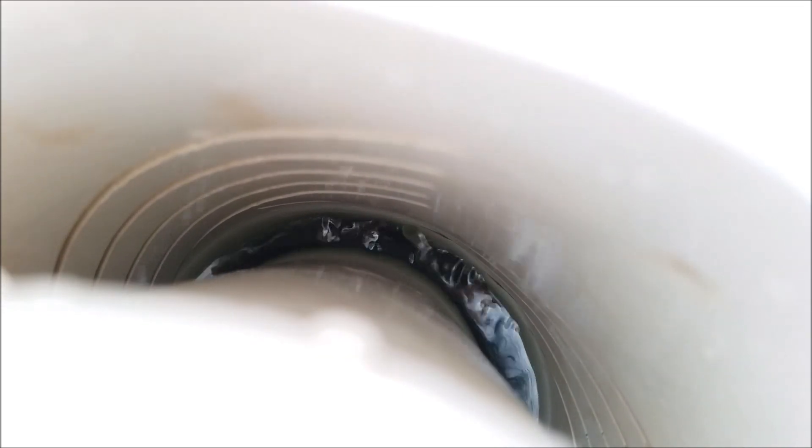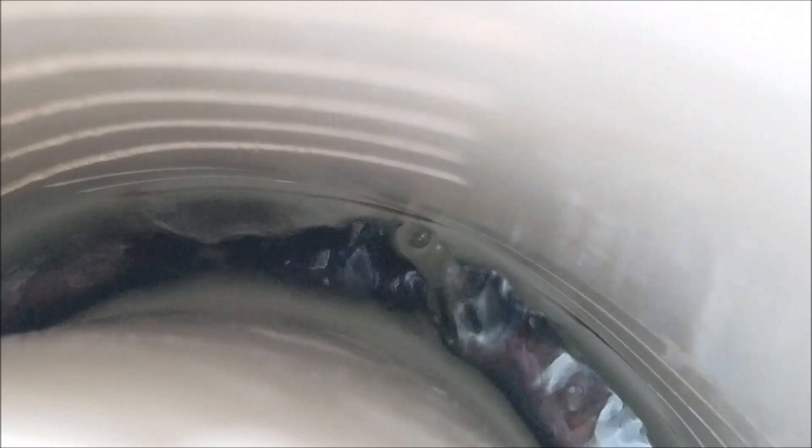It's almost at the bottom — I cut it shorter so I can show you how it actually works. You can see the pipe down there, and the water is going to go to that level and then the siphon will break. You can see the pipe coming out, water going below it. As soon as the water goes below the pipe, air will come through it. This basically helps it break faster because the air goes through the bottom of the pipe, helping the siphon break faster.